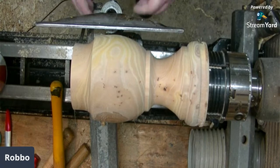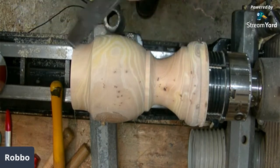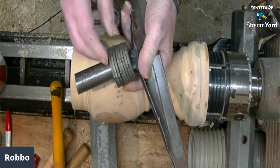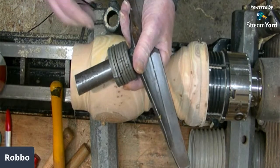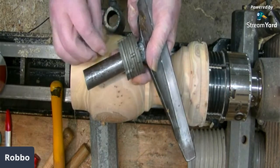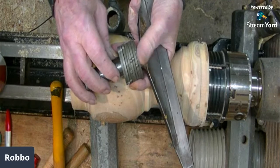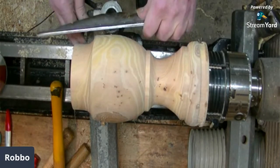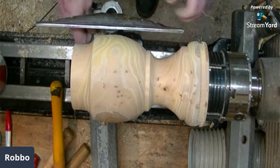Now, another little trick that I do with my tool post is I put it at the height that I want it. Soren has just joined, g'day Soren. Normally, I've got a nice collar or a hose clip on here so that when you're turning it around, it doesn't lose height all the time and you just have to lock it into place.